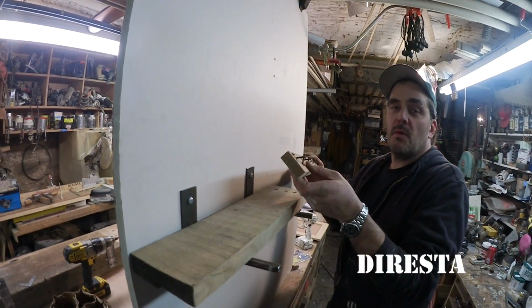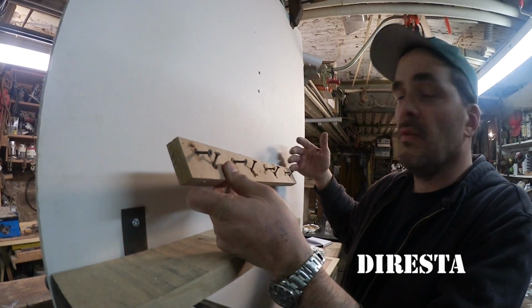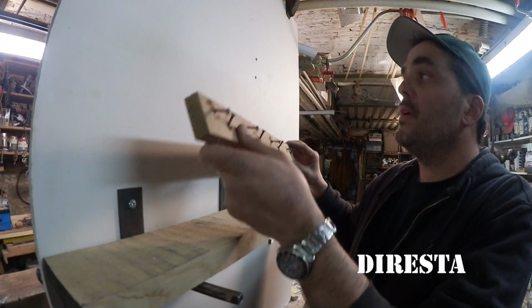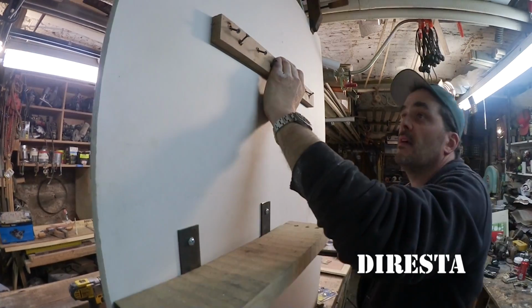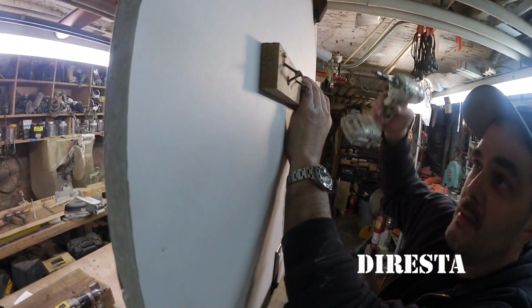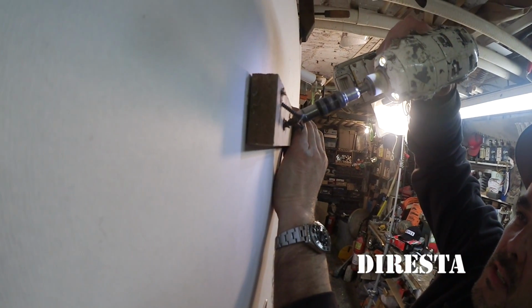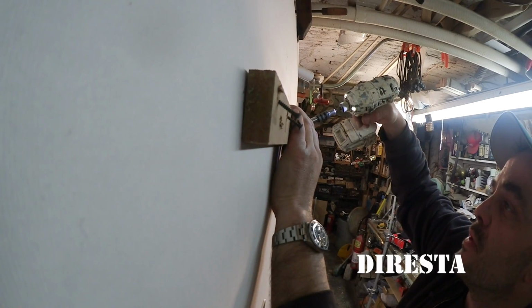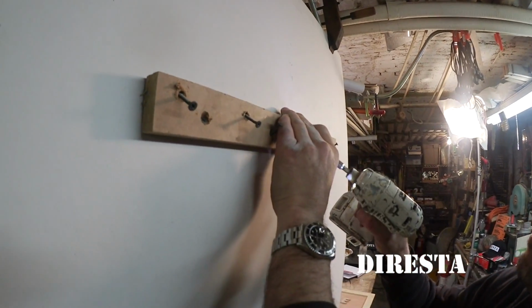Alright, sometimes you don't have the opportunity to put a nailer where there's a stud. You don't have toggles, or you should use toggles, but you don't have them. You're not hanging a 100-pound mirror, but you're hanging something that's got some weight to it. I developed this method called the Porcupine Method. It's kind of a joke, but it's never failed me. Where you gently screw in all these sheetrock screws at every angle.